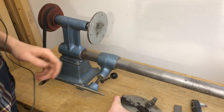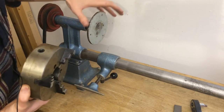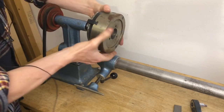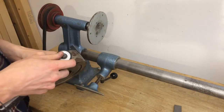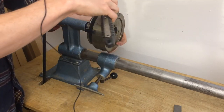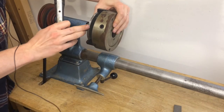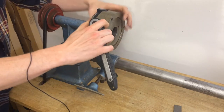The reason why I did that is because, as I mentioned earlier, this is the chuck I'm going to use, and in order to locate the holes I need to drill into this plate for bolting the chuck into, I figured I can just clamp the chuck onto the faceplate like that and use it as a drill guide. But to do that, I of course have to make sure that the plate is sitting centered in the chuck, which should be easier with a slightly more concentric outer rim now. Still expecting to have to do some adjustments, but now that I can see shiny spots all the way around, I know that it should be not very far out of circular.